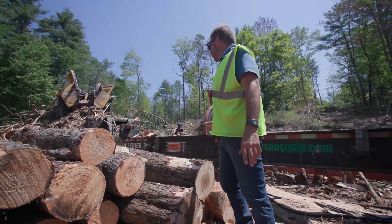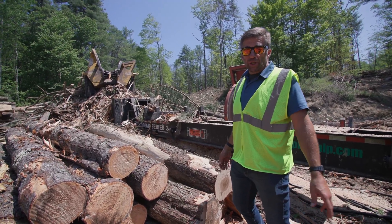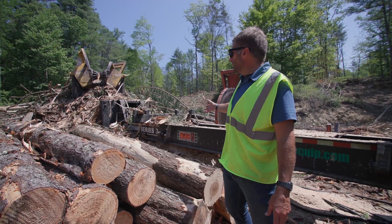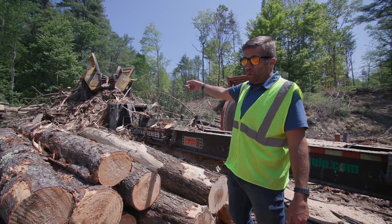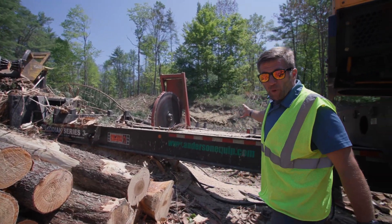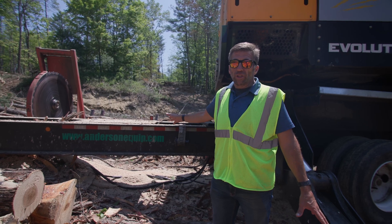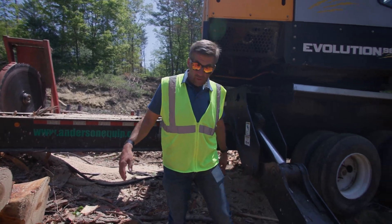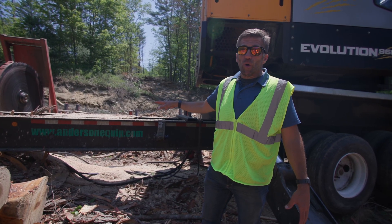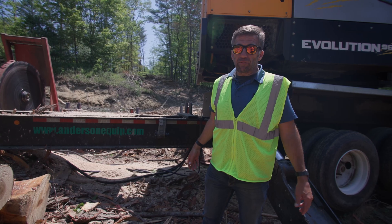The other thing I'd point out is that this is what we call a TMS package — Total Merchandising System. The machine stays in one spot; the loader is able to handle whole tree, pull it through the CSI, pull through the limber. Then the tree is taken from there, cut up with the Propax saw, and sorted for length. This is a good system for when you're doing one job and the machine is going to stay in place. It's also mounted on a Big John trailer, so all these components on this loader are all a package — a complete turnkey operation that Anderson sells.